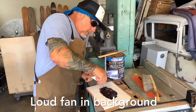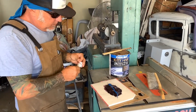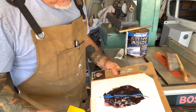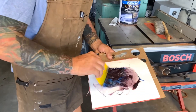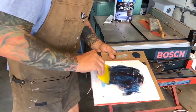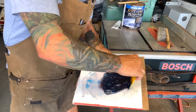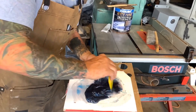I decided I didn't want to use the lightweight body filler because the gaps were too big. So I'm actually mixing up some kitty hair — it's a long strand reinforced fiberglass body filler — and it's extremely great for filling areas that you never want to come apart. We're going to mix this in really well, then mix up some body filler afterwards, and then after that we're even going to use some finishing putty.